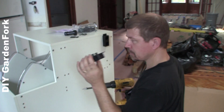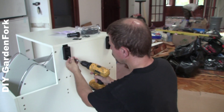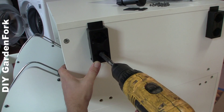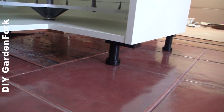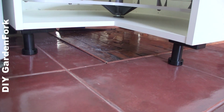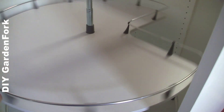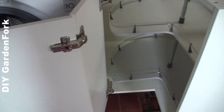The feet — we use the inexpensive plastic feet. They go on like that, and I like to put a screw in to hold them. Turn the knobs to level your cabinet. Also, install the carousel before you put the top or the doors on — it's much easier. Corner door.